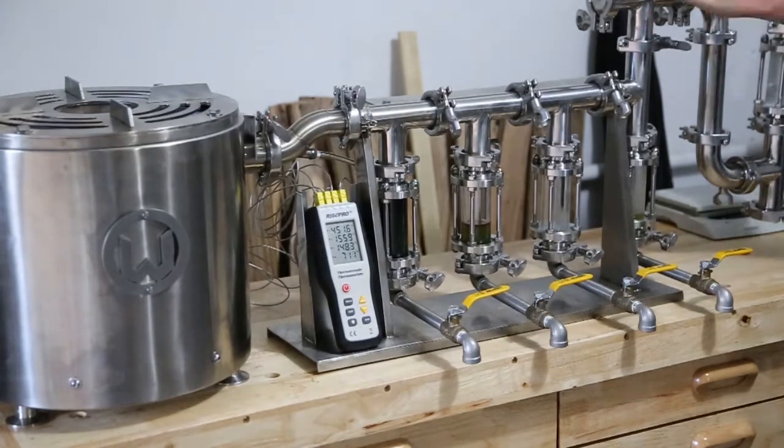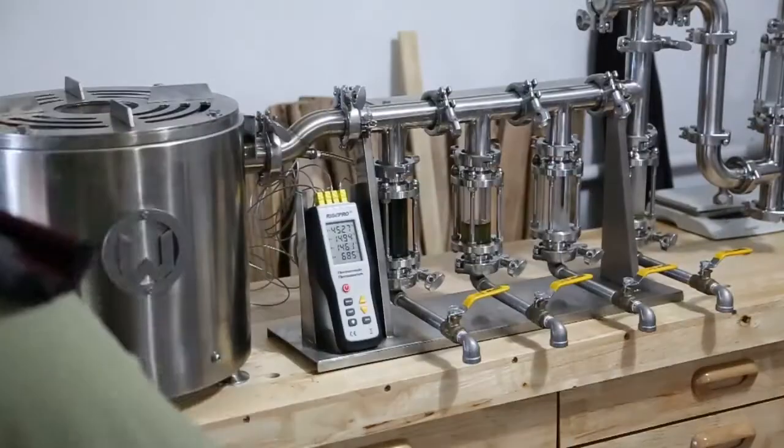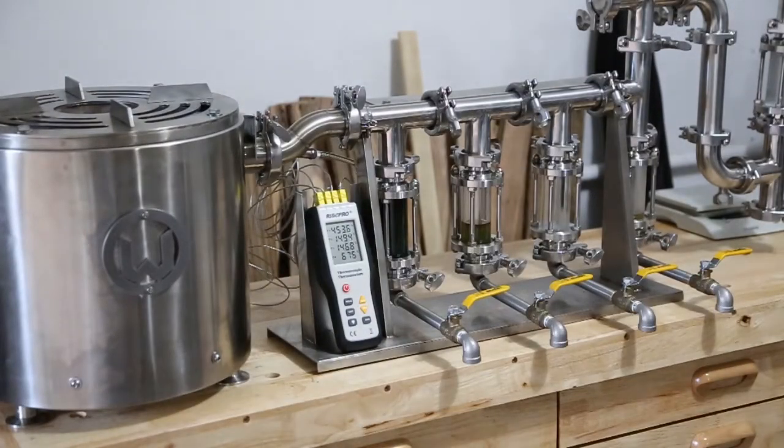I check the heat on everything and fire it up a bit more. It's been at 450 degrees for a while, so I bring it up to try to generate some more fuel, but I don't really see any more coming into the columns. What you do see is the bubbler going — if you zoom out you can see it on the far right of the image — so we're making more gas. I anticipated going until gas bubbles stopped, but it just took too long, so I eventually turned it off.